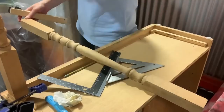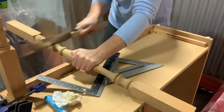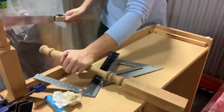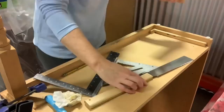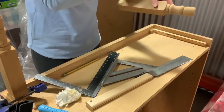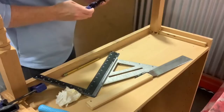Now I'm cutting the other front baluster to match the one we've already done. I'm going around in a circle to make sure I get a fully flush cut all the way around. The back legs are not going to be done with balusters — they're just going to be done in two-by-two furring strips that match the width of the top of the balusters. So the front will be fancied up with balusters and the back are just simple legs, because you don't really see them, but they still match because they're the same size and shape.